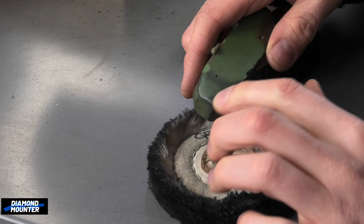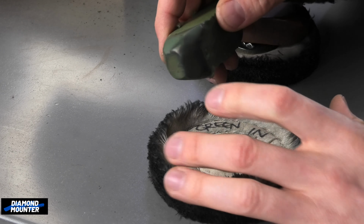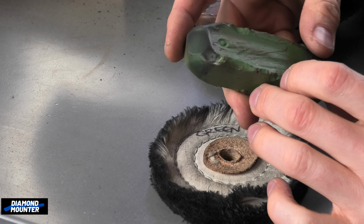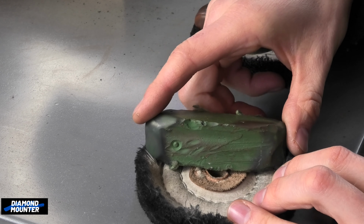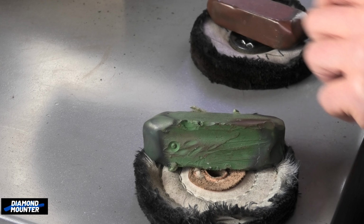But it's less dusty, it's a bit less greasy, less of it comes off and gets airborne, so just for that reason it's a nicer polish to use, and that's partly why, well really the main reason why I stopped doing yellow gold with red and just do yellow gold with green and white gold with green as well. So most of my polishing is just done with green. It's only silver really I use red now for.